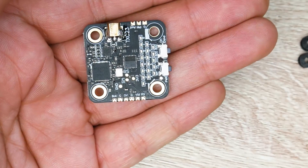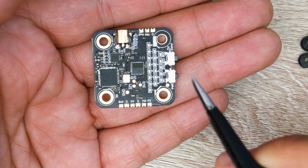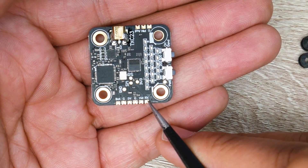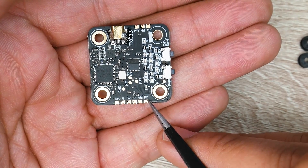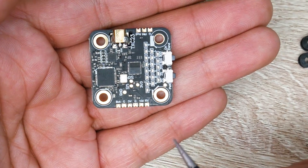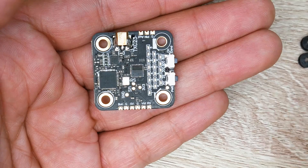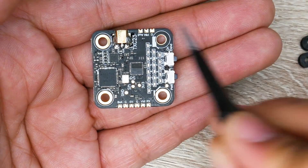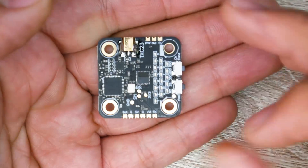The VID wire is the yellow one — connect it to your flight controller on the VTX pad or Vout pad; they have a few different names but make sure it's an output pad. The RX pad is very important: connect it to any open TX pad on your flight controller and enable smart audio. For example, if you connect RX to the FC's TX2 pad, then in Betaflight's ports tab find UART2 and enable smart audio. That'll let you control the VTX through the OSD without having to press the buttons on the board to change channels.